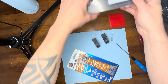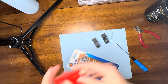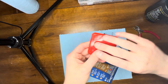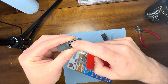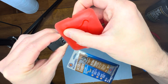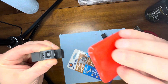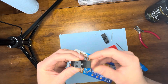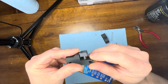So I'll be back and I'll show you. I bought these little tools from Amazon — they were six bucks, they're for doing silicone. They come in a variety of different styles and that's what I'm going to be using. So I'm going to insert the screw to block the hole to start with, fill the cup with silicone, and then just run this across and down and swipe this way to clean it off. The excess silicone should be on the tool, leaving a nice level surface, at which point I'm going to remove the screw and let it sit and cure.